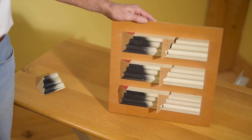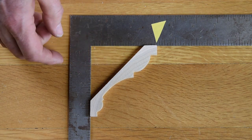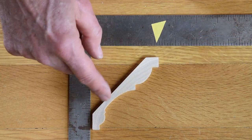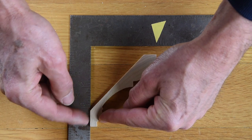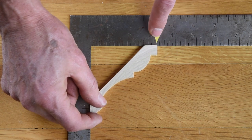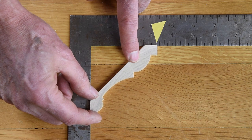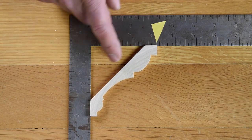So we can see how important the miter cut is — it needs to generate the right cope line at the right depth so the cope is the right depth to fit into our molding. We need to measure the ceiling projection of our crown. You want to make sure you start with a flat piece that's not cupped, because that's going to throw your measurement off. I like to get the bedding foot on the wall and then slide the crown up until it touches. We're reading three and one eighth inches. You could make this three and a sixteenth or three and three sixteenths without much trouble, but you want to pick a ceiling projection and stick with it. We're going to use three and one eighth for this crown.